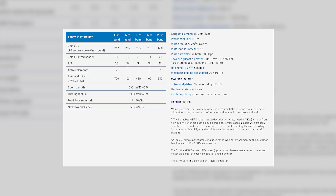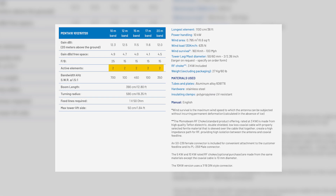Do you have any most popular Yagi recommendations? If I just want a really good mobile beam Yagi, where would you start? If you're looking for an all-around antenna that works on multiple frequencies, I would definitely recommend the Penta 10. It has 10 elements — two elements for each band — covering 10 meters up to 20 meters, with the WARC bands in the middle. The boom is only 3.9 meters, so it's very compact and easy to install. You have a lot of frequencies on one feedpoint, so it's perfect to start.